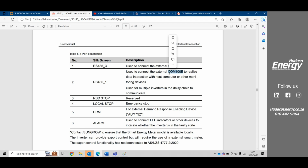A truck always wants to be carrying a load and making money, but other than that, that engine has been designed to carry a load, and when it no longer carries a load, it can damage the engine. Same with the diesel generators, they need to run with the load, and hence you get the piston glazing because it's freewheeling too much.